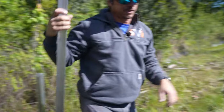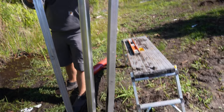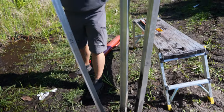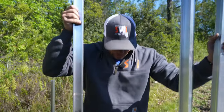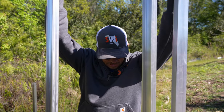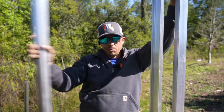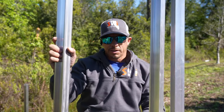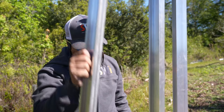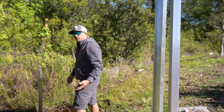I'm going to tell you right now, 3 feet right here is good. We can bend the post and it's still very difficult to pull it out of the ground. I've gone to aluminum fences here in Florida where they used their whole whopping 6-inch hole, set it in concrete with half a bag. Half a 60-pound bag, so maybe there's 30 pounds, and we pulled the post right out. We were able to wobble it around and just pop it right out. These are infinitely harder than a lot of the posts that we have had to pull here in Florida, done with concrete, because they're deeper.